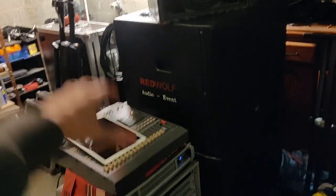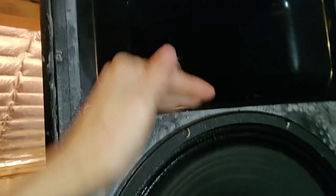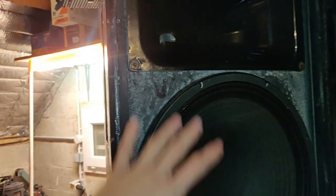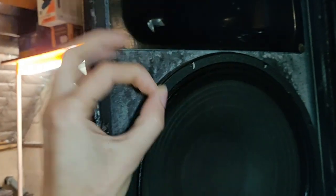I managed to put my hand on a pair of EAW JF560 for quite a good price. And I compose with 15-inch and a 3-inch clear horn, which is stupidly huge. And I like this arrangement because it makes your tweeter go a little bit down the frequency. That way you have all the kicks and bass that comes out of the speaker. It gives a very, very cool sound. I tested it on rock music and it's very, very cool.